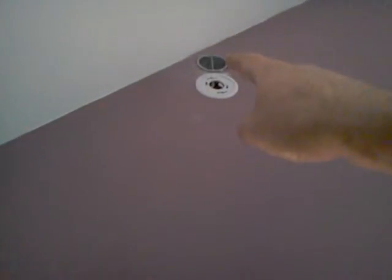So here's one duct. Comes in from the bathroom, right here. It's going to take air, ventilate the bathroom, take air from the bathroom, and really from throughout the house. And then the second duct is up here. And so these are taking air in from the house, and the vent that's pushing air into the house is underneath this awning, and it pushes air into the kitchen.